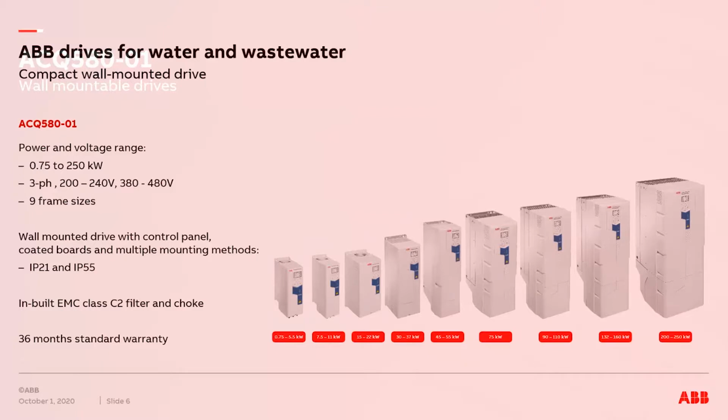Now when we look at the wall mount units, we have all the different frame sizes, from 0.75 up to 250 kilowatt. In total, we've got 9 frame sizes. Of course, the voltage limitations are 200 to 240 volts and 380 to 480 volts. We don't have a 525 to 690 volt available in this range. That would then be moving over to the ACS880.